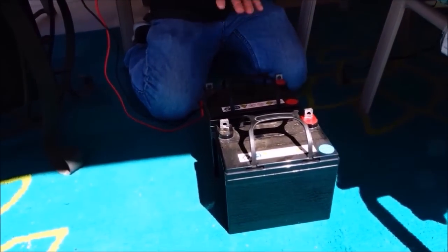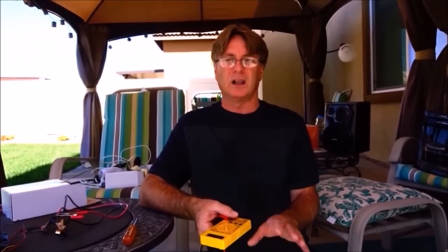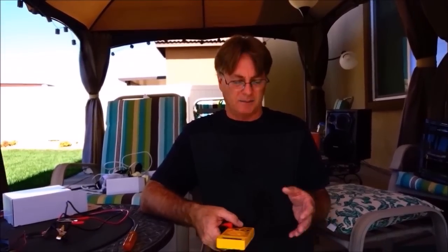There are all different kinds of batteries out there. People always say you could have got a 100 amp battery for the same cost as this 35 amp battery. One reason I'll pay more for the AGM battery is because they are made to have power running through them — be discharged, recharged — everything for a very long life. If you only discharge them 50% of the way, they will last a thousand or more cycles. You might find a more powerful battery for less money, but these are very safe and meant for this use.